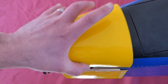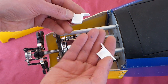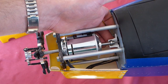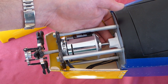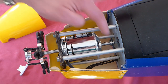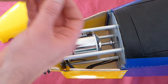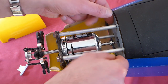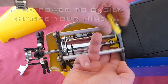While we're here, I mentioned we were going to put a bearing to support this shaft. I had 3D printed these bearing holders as a clamshell — the idea being to tack glue them to the firewall and then fix them with self-tapping screws. Since then I changed my mind and decided it would be really useful to also put a bearing on the inner shaft. So I've redrawn and reprinted new clamshells with an extra ridge to take that extra bearing. These will fit in the same way. This of course is the power of 3D printing.